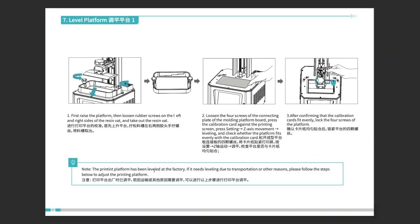When I got to the point where I would normally loosen the build plate to level it against the LCD screen, I saw a note in the manual saying the bed was factory calibrated. It did say you could re-level if needed due to transit, but I didn't really know how to tell whether it had been dislodged, so I decided to just give it a run. I want to state that I do not recommend doing that, because the only way you'd know the build plate wasn't leveled correctly would likely be when it is crashing into the LCD screen — the most fragile part of this printer.